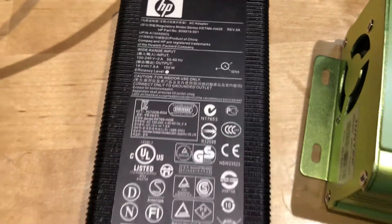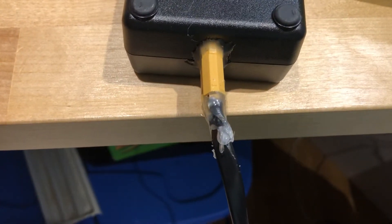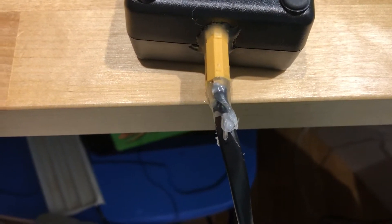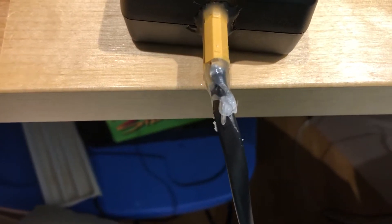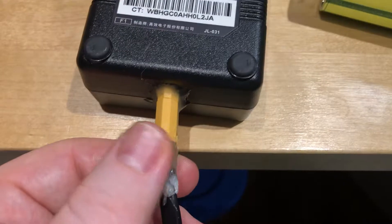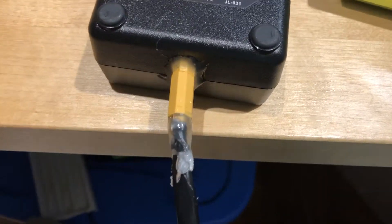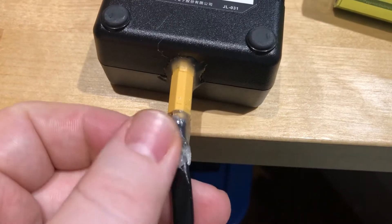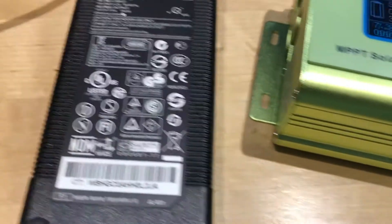I took the power supply apart because it had a weird cable — the ground was wrapped around the positive, wrapped around a signal wire, almost like a bullseye cross-section. So I took it out of the adapter and soldered on an XT60 connector. It's ugly and I'll still heat shrink it, but I just did this tonight to test it out.